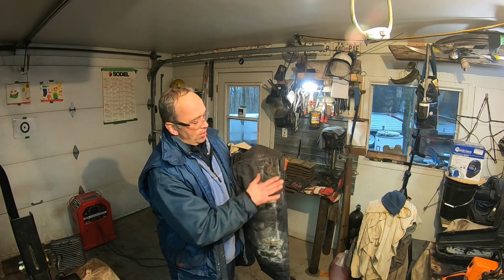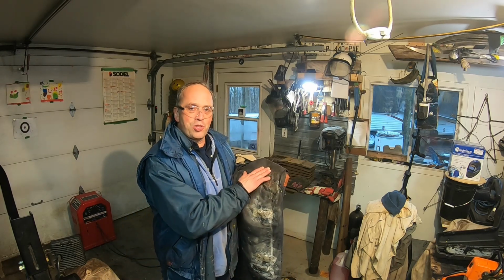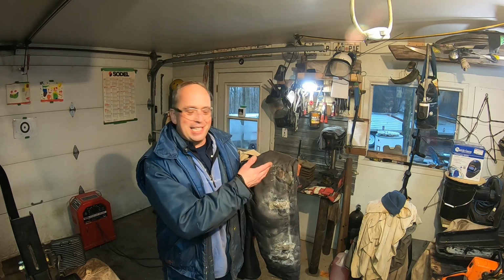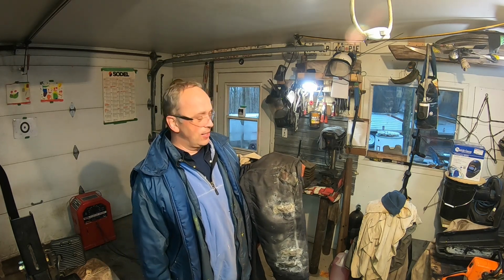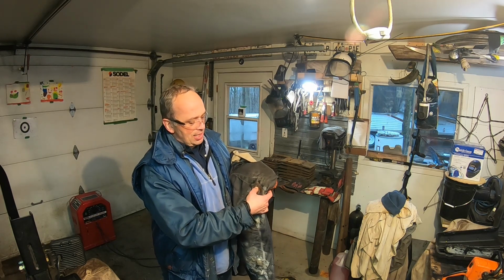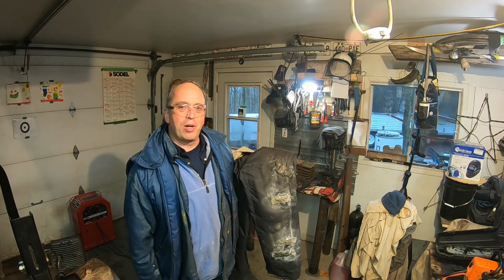Yeah, so I didn't make a video on how to do that. You all know how to use contact cement. You put 3 coats on one surface, 3 coats on the other. You wait until they're tacky before adding another coat, and then you just smash it together and press it. You're supposed to wait 7 days before testing it, but I did it this morning at 6 o'clock. So it's been a good 2 hours, and it's already stabilized. It still moves a little bit there, but well, we're going to try it. All right, so let's go there.